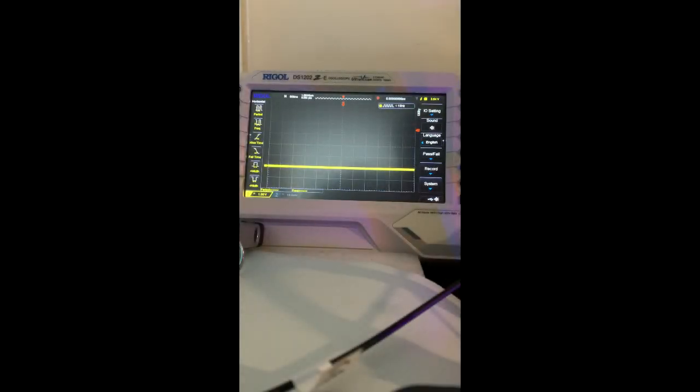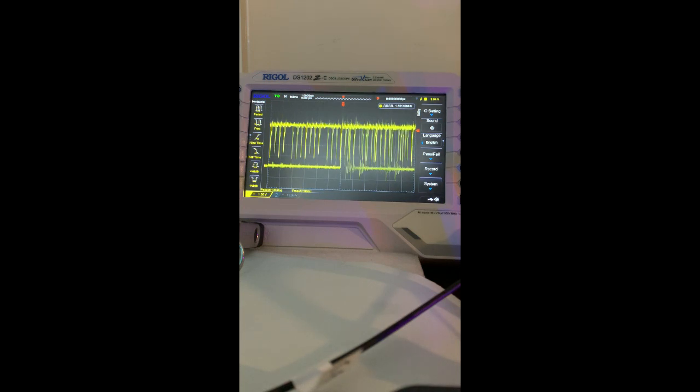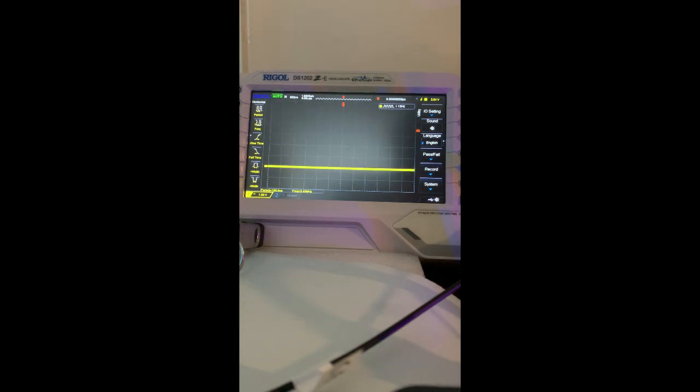So these are the signals on the LS174, which is coming in from the first LS157 on pins 4 and 3. You can see that's pin 4 and pin 3. They look quite healthy. So if we look at the 3 signals coming from the other LS157, these are on pins 14, 13 and 11.